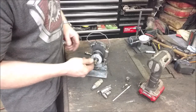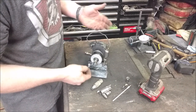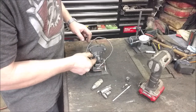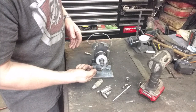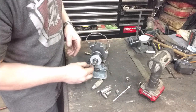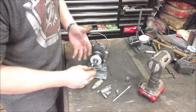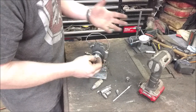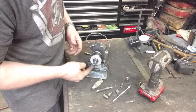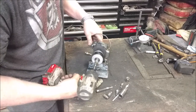Attaching this little piece the way I wanted to was a failure — I didn't even realize it, but that's cast iron. This is a cast iron crank; you can see back here that it's cast. It just cracked right off. So I went about brazing it. The hole in the center isn't centered, so with brazing everything can still move. I ended up just taking a socket that would fit over it, so now I can just use a drive bit like this and jam that in there and it'll work.